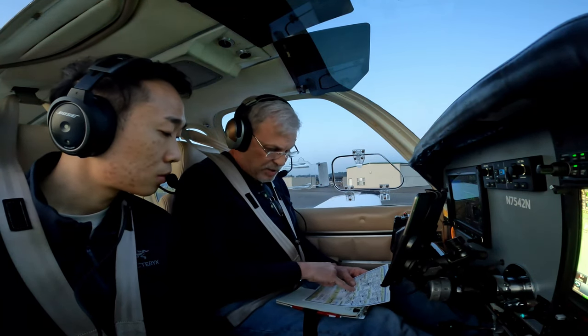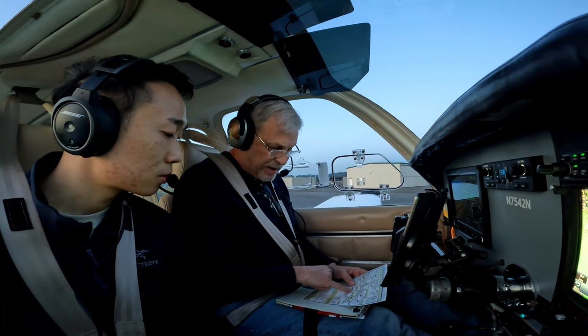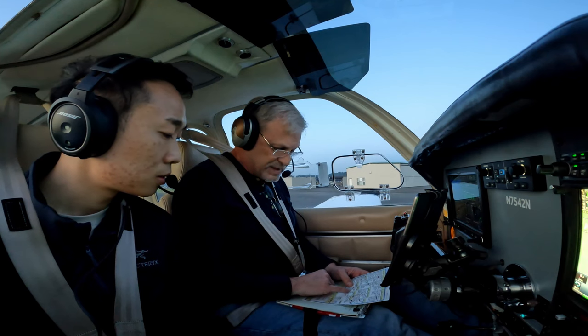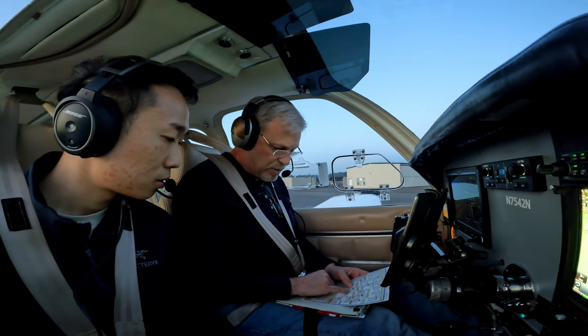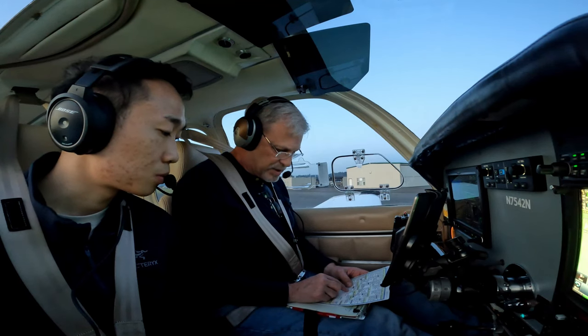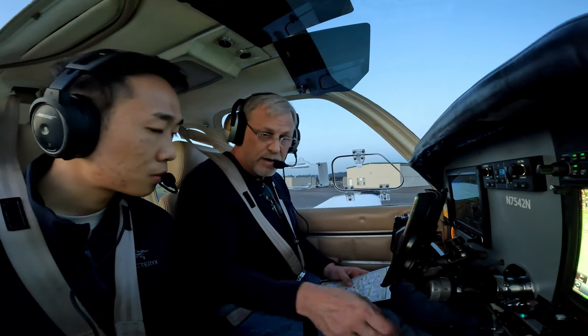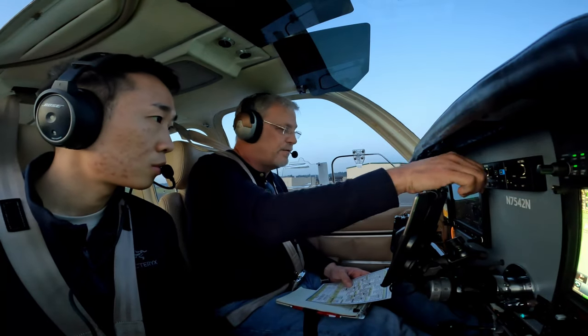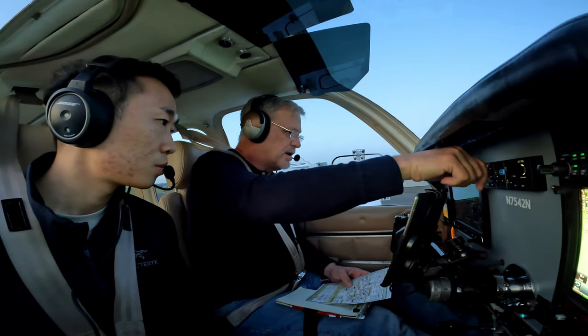No flaps. Full power, everything. So everything's forward down here. And the fuel pump is never on in this, unlike other low wings where you put on a fuel pump. You never put it on except for starting or in emergencies. Pitot heat as required. Pitot heat is here should we need it. Heading bug will be set to 342. So why don't I go ahead and set it?